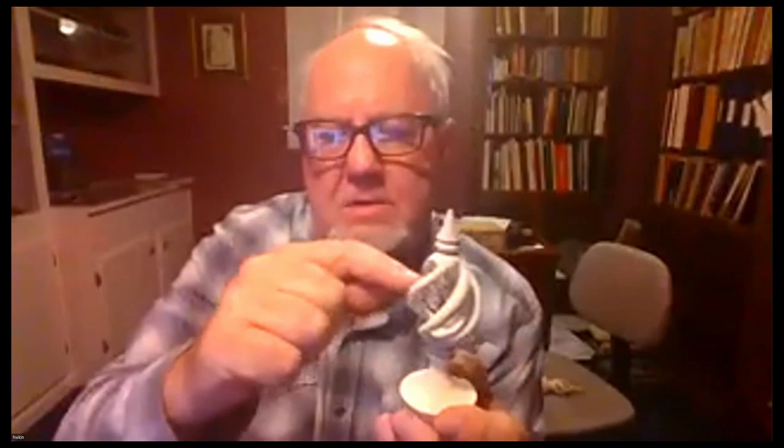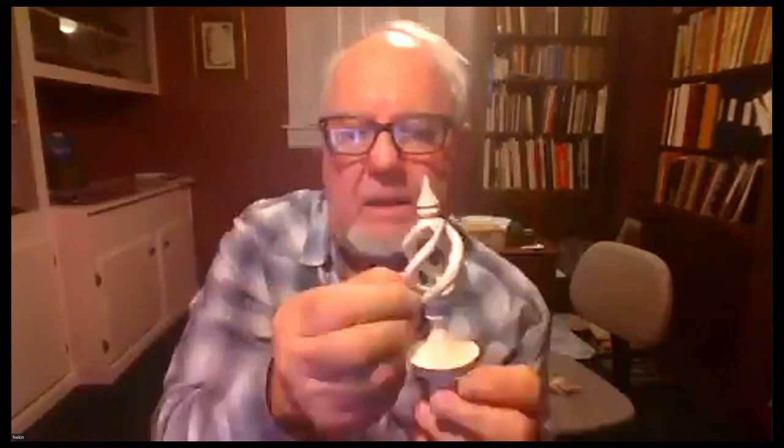But the problem is, a lot of these tines are side grain, because the grain's going this way and you've just got slivers of the thing holding. So to get this final point on here, I take masking tape and wrap it all around here to kind of hold that together, because I don't want this to twist and break. You finish up with strips of sandpaper, take files and sandpaper, keep working, get all the inside sanded as best as you can, which takes lots of elbow grease.